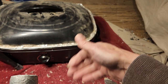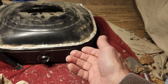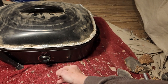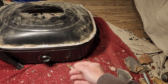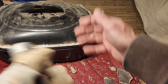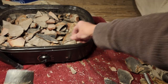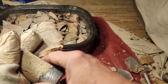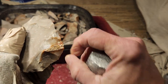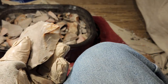It doesn't matter how often you do this. It doesn't really affect the stone. They're fine. All right, you let it sit at 350 for, is it 350? Yeah, 350 for 4 hours. Turn it off. Let it sit for 12 hours. Take the lid off and test them all. Take little flakes off. And maybe you start seeing glossy. Ooh, glossy. All right, so here we go.